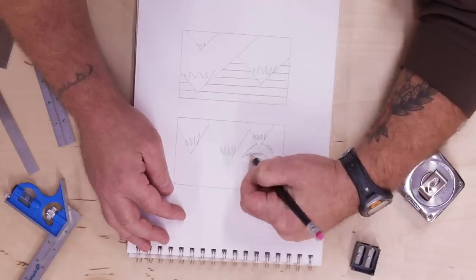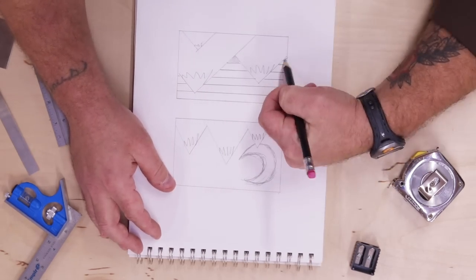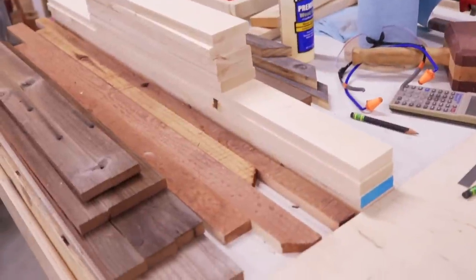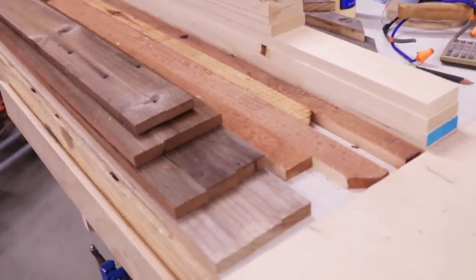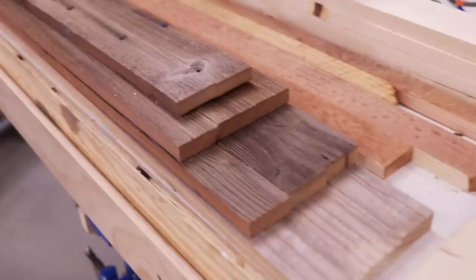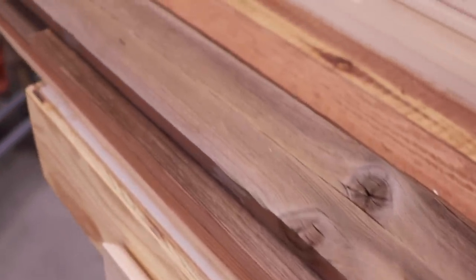Like most things that I do, I like to sketch something out and get a good design down first, and that's how I'd start these two projects. I'm going to do one of each and show you guys how I go about doing them. As far as material goes, I like to use fence board — that's my number one go-to for mountainscapes. The reason is because they're cheap; most of the time they're free. I like to plane one side, square up one edge, and then rip them through the table saw to one to one-and-a-half inch strips.